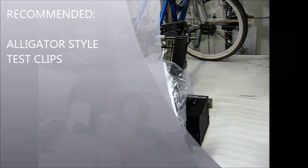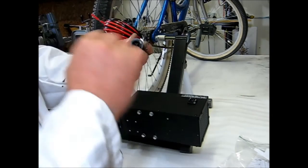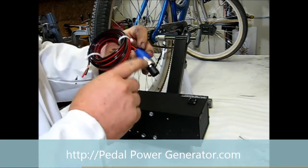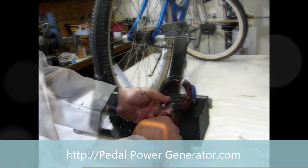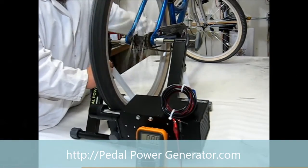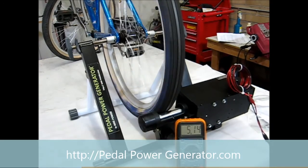Coming with the system is a generator cord — it's 12-gauge wire, which is rated for 20 amps. Don't force this at all; there's a wide feature on the barrel here and a narrow feature. Just slide those in real gently with the metal facing upward and you should click — just like that, now you've got connection. Here's our voltmeter set to DC voltage. Looks like we hit 14 volts.